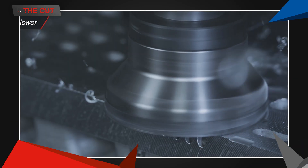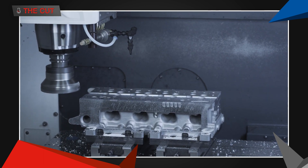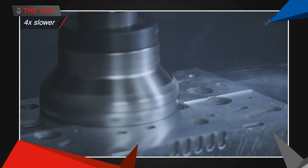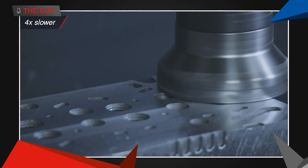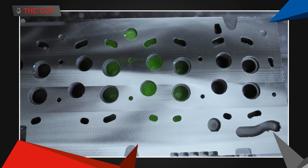What are the most typical types of components for which a face mill like this is used? The face milling cutter is made for all face milling applications, but first of all the tool has been designed for complex workpieces where many holes and pockets are contained where chips can drop and stick in. Typical workpieces for the MaxiMill SEC12 are gearbox housing, engine blocks, and battery trays. So it's a pretty versatile tool that can be utilized for a number of different applications.